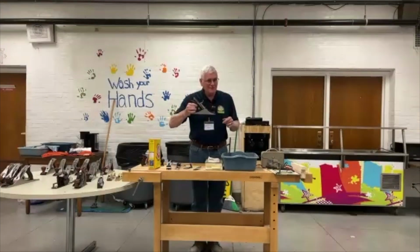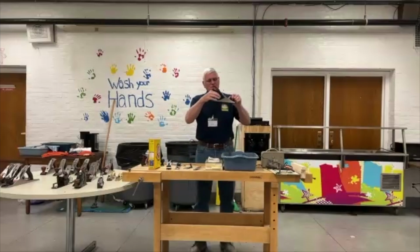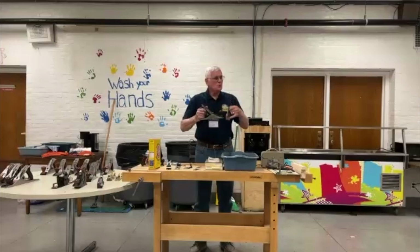Somebody gave me a gift of a hand plane because they knew I liked hand planes, and it had plastic handles on it. And the adjuster was not brass. It was a metal. I don't even remember what kind it was, but that's this plane right here. So I took it all apart, flattened the bottom, sharpened it, put rosewood handles on it. I liked it because it's so darn heavy. The heavier a hand plane is, the easier it is to use.